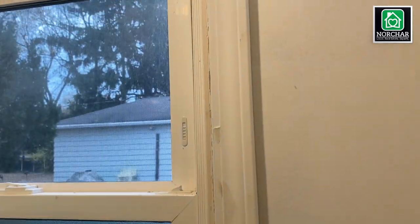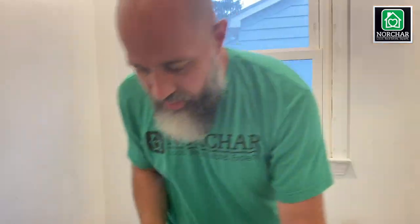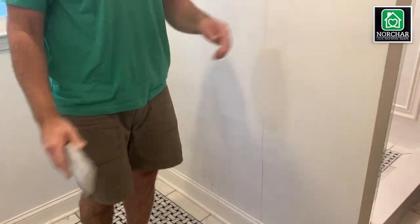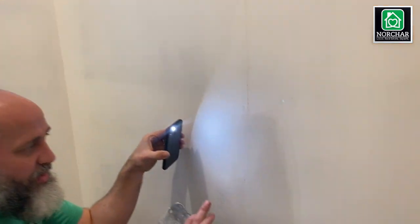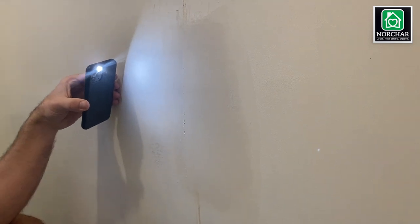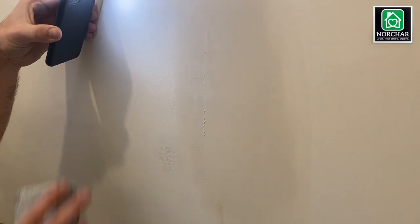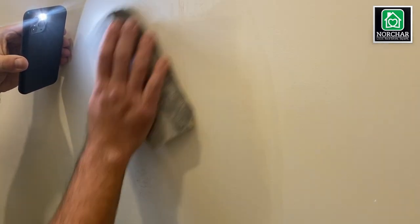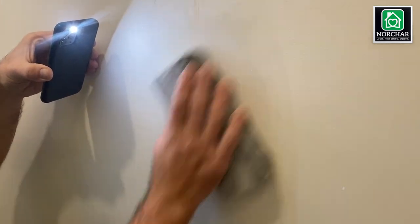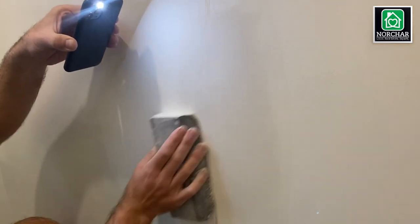Here's a giant tip: always use a flashlight when sanding drywall on flat surfaces. It will show all of the imperfections and help you get a perfect finish. If you look here, you can see lines and striations that would look terrible if you painted over them right now. So leave your flashlight across the surface, see all those imperfections, then lightly come in using a turning method. Start by getting the big ridges off first — push very lightly and let the tool do the work.